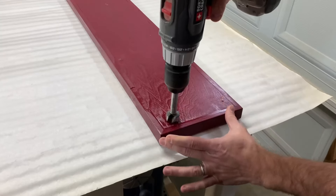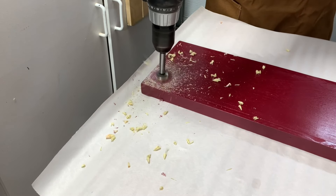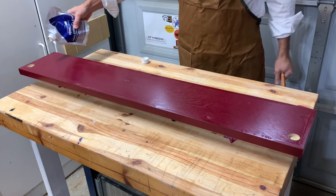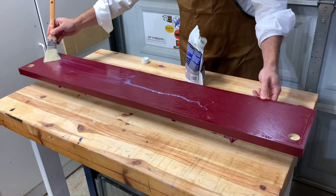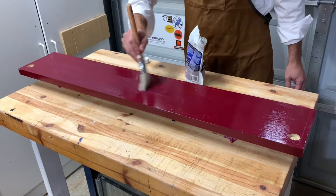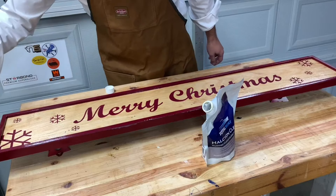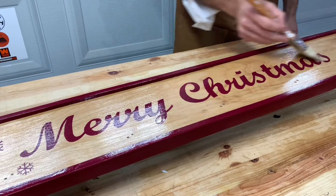Here I'm taking the hooks off to get it ready for finish. First I went through with my Forstner bit and put a little recess in the D hooks I'm going to install later. The reason for that is because the hooks on the wall that this is going to hang on stick out from the wall a little bit, and we didn't want the piece to stick out too far. For the finish I'm using Total Boat Halcyon clear finish — it's a gloss finish. I love this product. It's super easy to apply and clean up, it's water based, but it has self-leveling properties so you get a really smooth finish. I did that on the back and front — you can see it's bringing out the grain and that nice burn on the plywood.